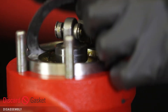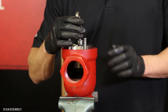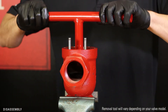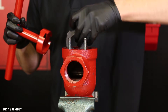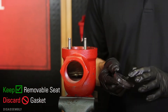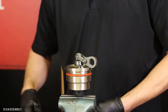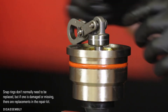Discard the gasket on the cylinder — it may be stuck to the bonnet. Pull up on the trunnion hub to remove the piston assembly; you may need to use a screwdriver for leverage. Use the Kimray seat removal tool to remove the seat. Discard the gasket and inspect the removable seat and threads for any damage. Remove the valve body and put the piston assembly in the vise by the lock nut.